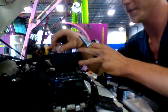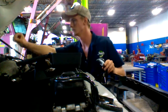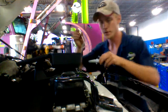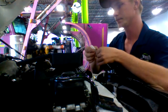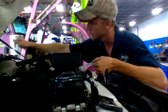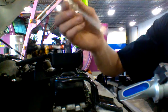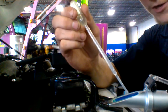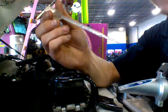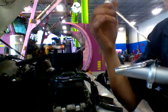What you want to do is you want to take the dropper, get a sample of your coolant. Take it — one or two drops. Remove the cover of your refractometer and get the drops on there a little bit, then close the lid.